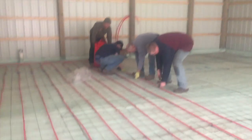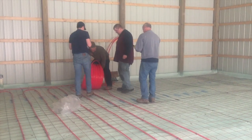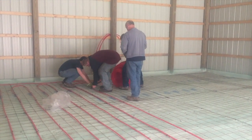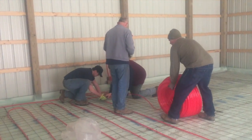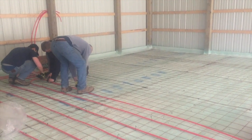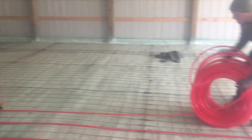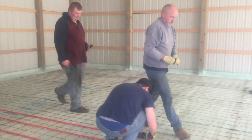It's a lot easier to go the length of these rectangular buildings. Start your headers somewhere in the center of the front or back and roll it lengthwise, because you've got less bends. If you roll the tubing sideways you'd have a lot more turns. When turning a corner with the roll, just roll it right around with yourself — don't flip the roll over. If you start pulling from the side of the roll it'll get all looped up and twisted because of the memory of the roll. You want this tubing really flat. You'll know if you flip it wrong because it won't lay right.